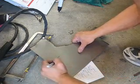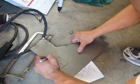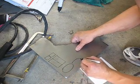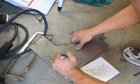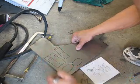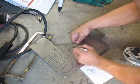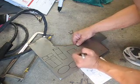Starts off with that drawing, and after I get the drawing from the client, I take it over to my metal area and doodle that out on some sheet metal with a Sharpie. It's 22 gauge sheet metal, about automotive grade. I actually used to use automotive sheet metal for the work that I did, but welding on painted and primered car metal kind of sucks. The smoke and the fumes start to get to me, and headaches and all that.